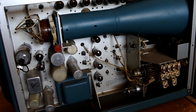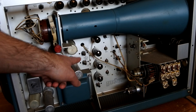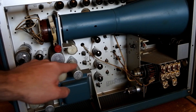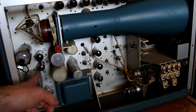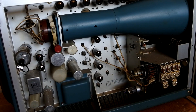Here's the other side of the oscilloscope. As you can see, this side has a lot of tubes — some up here, some down here, which are the deflection tubes I believe. Here are the other side of the calibration controls, and over here we've got our power supply and horizontal output tube. We also have a regulator tube down here — I believe it's an 85 volt regulator. There's an absolute ton of electrolytics which will all need to be changed at some point, which I plan on doing in the future.